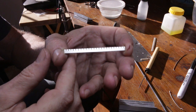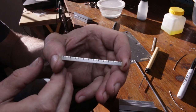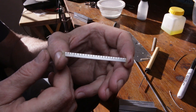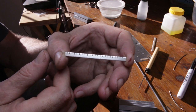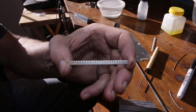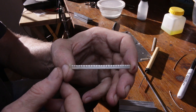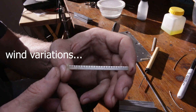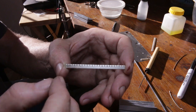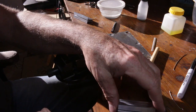Okay, here is a piece of bezel material. I believe this is 18 gauge that I have already created the serrations on. If you look carefully, if you pause your computer, I'm sure you'll be able to find some cuts that are not as deep as they should be. Maybe a couple of cuts are deeper than the rest, and that's hard to avoid even if you get in a groove, no pun intended, and you're really careful about being consistent in the number of saw strokes that you take. The angle that you're holding the saw, the amount of pressure that you're applying, the speed at which you're sawing, if that's not all identical from cut to cut, it's really hard to keep the individual cuts identical to one another. And that's why I came up with the Bez-jawZ.